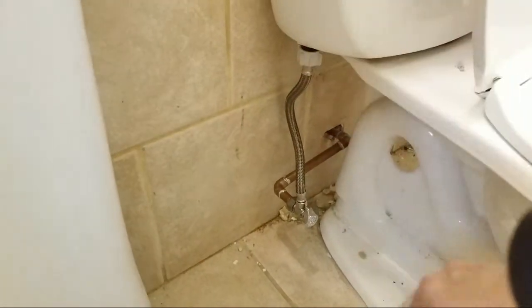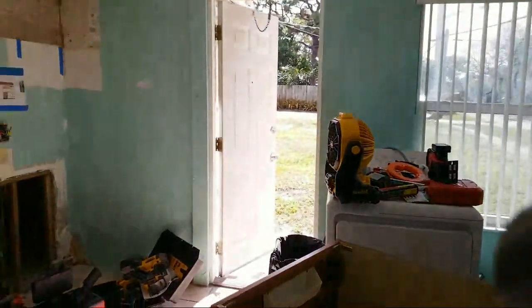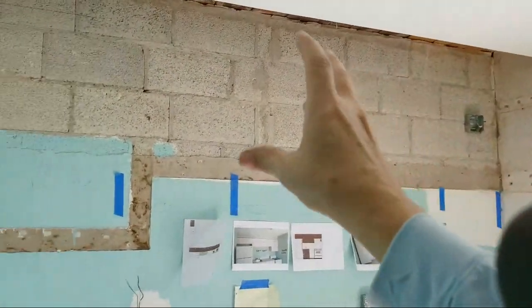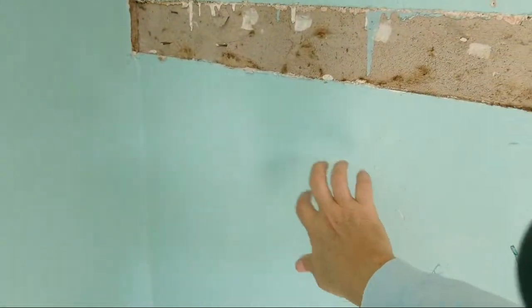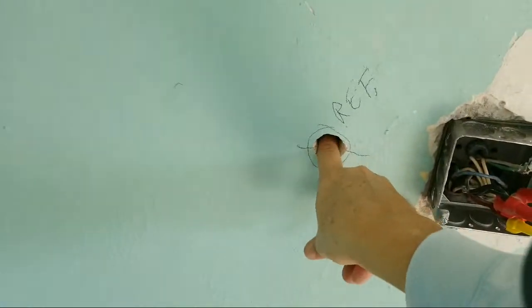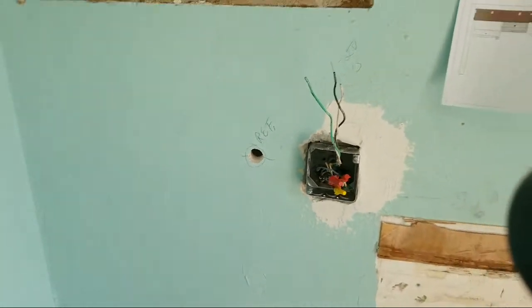On Saturday it took me about an hour to get the old mess out of there. They had shark-bite fittings — I replaced those with soldered copper. This won't meet code either, supposedly — code wants it to come straight out of the wall, but the plumbing stack is right there, a big wide stack, and there's nowhere else to really route it or poke it through. People need to be able to reach that shutoff valve in an emergency. Sometimes you're at the mercy of how the builder originally did things.